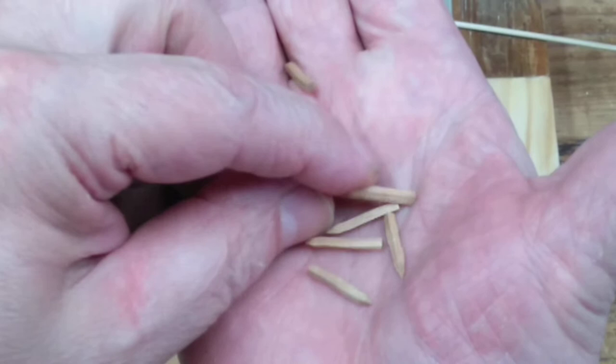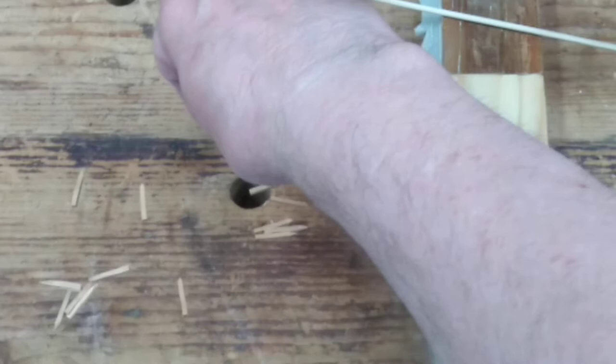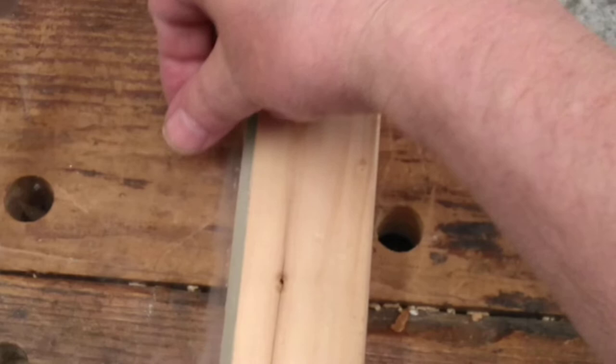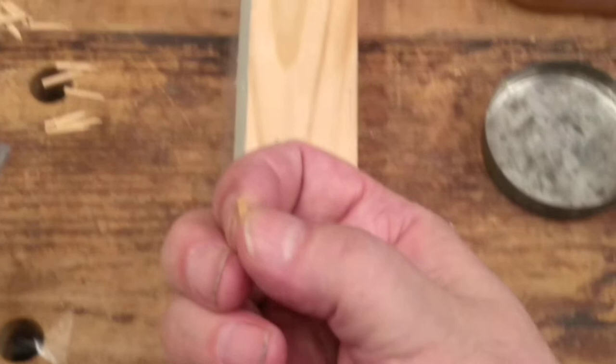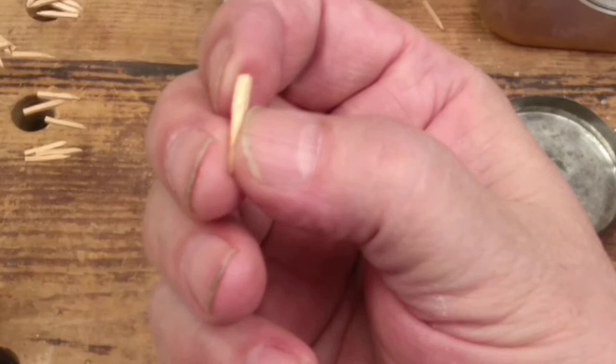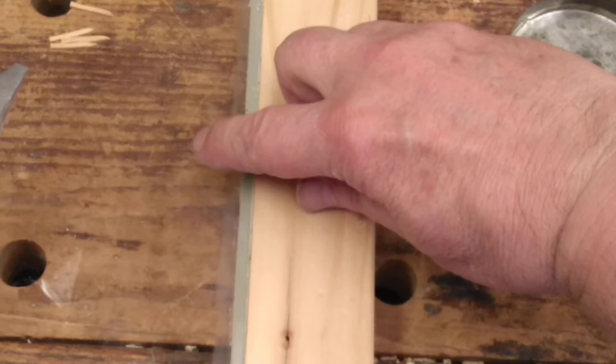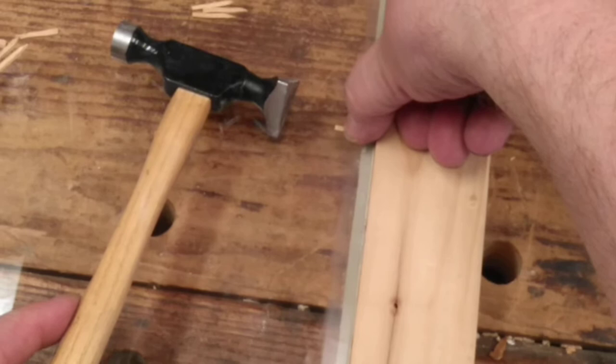So what we found in New Brunswick was that the glass was held into the window sash with wooden shoe pegs. They're made out of maple, and they're just about 1/16 of an inch across. And you can get them in different sizes, but this 1/16 inch size is what we found. And I managed to latch onto some myself. So you use them just like a regular point.